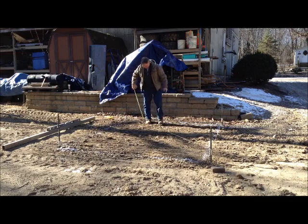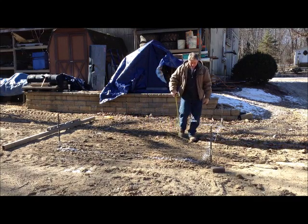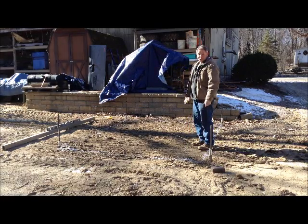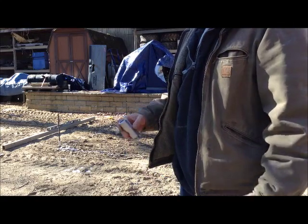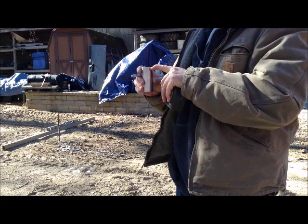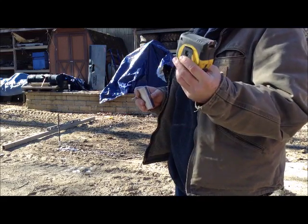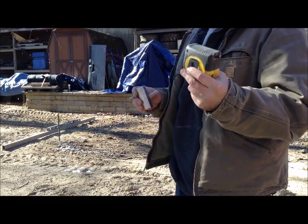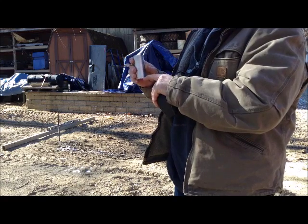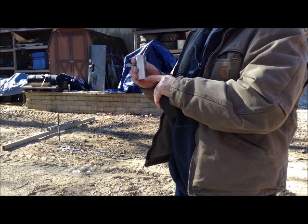If we measure down, we make sure we have the correct depth. We're installing our pavers for our primary depth — we compact the soils and we're ready for our gravel. At this point our excavation is complete and we've set our string line in the top groove of our sleeve to check our depth. We've measured around, made sure our depth is correct. Now we can take our tape measure and throw it in the toolbox for the rest of the day. From here on in, we're going to use the corresponding grooves on the sleeve to get all the rest of our elevations.